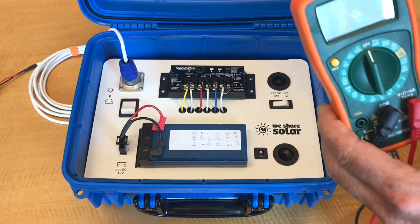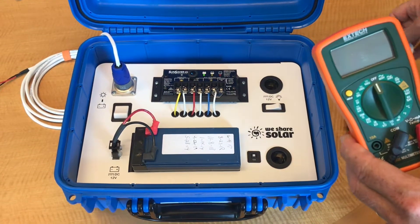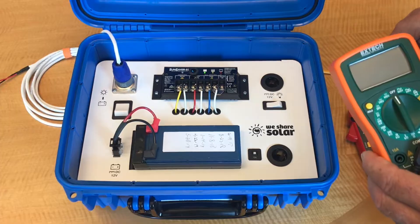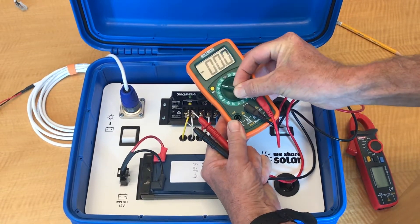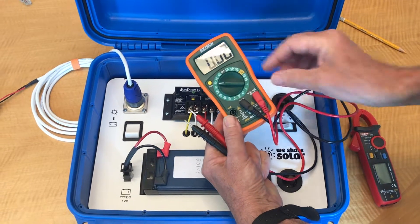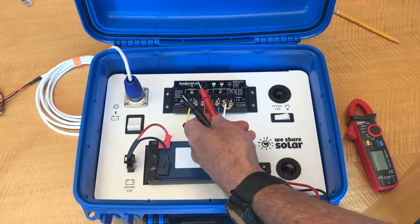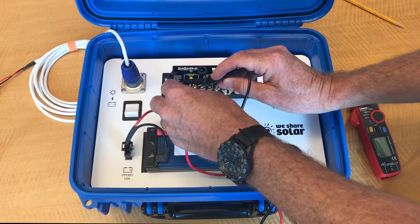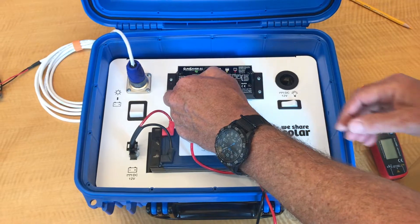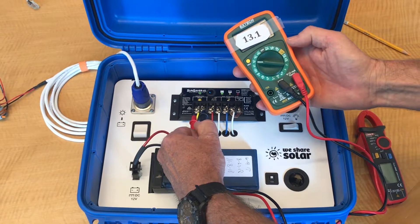Since we're indoors, we're going to be using paper values on the multimeter to indicate the voltages that you should be reading, because we want it to match with our PowerPoints. To measure voltage with the digital multimeter, first turn it to 20 volts DC. Make sure the red lead is plugged into the voltage port on the meter. Then take the two probes and put the red on the solar positive and the black on the solar negative to get your solar voltage. In this case, the solar voltage reading is 13.1 volts.